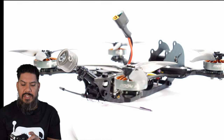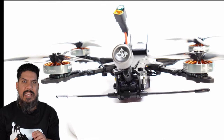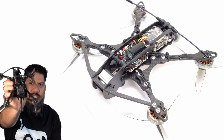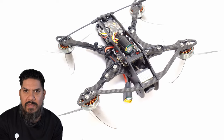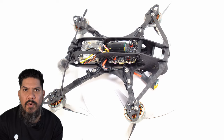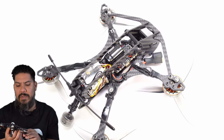Before we close it out, let's just round out the build here. I'm using the Jhemcu 20x20 all-in-one 35 amp. This can go up to 6S. I mounted the capacitor in there. It's the big one. So this is like more than enough headroom. This could do 6S 5-inch. So for 4-inch on 4S, I mean, this is just even overkill, but it's so cheap. I love using this board. I'll have the link in the description below if you want to check it out.